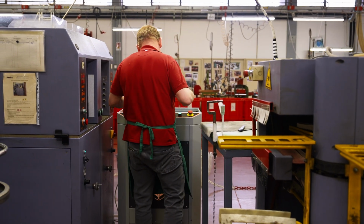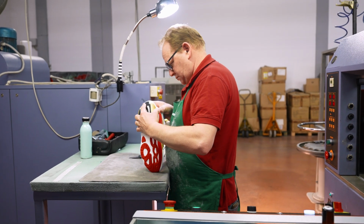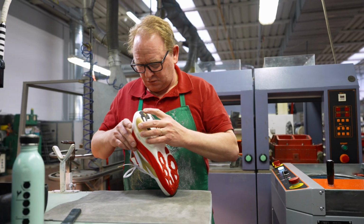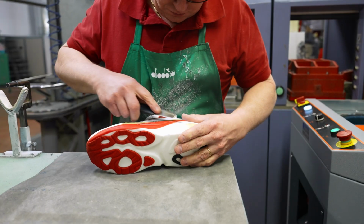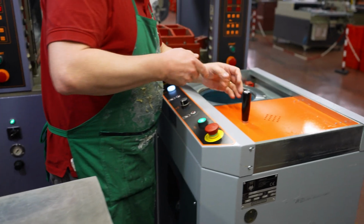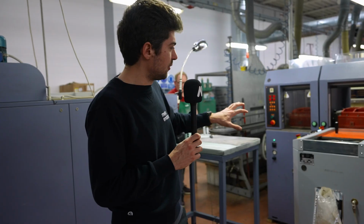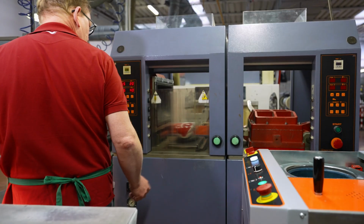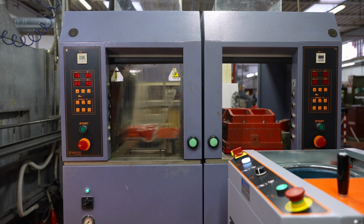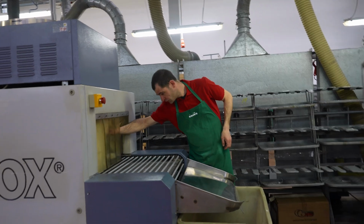Yeah. So, like I said, the glue was being activated in the oven, and now it's being assembled manually here. Literally, the two pieces are being taken together and put, just like you would put your iPhone screen protector on your screen. They need to make sure that it's aligned, that it's looking good, and then they just throw it inside that pressing machine. So it's like a silicone pouch that is being compressed so that the gluing process can be effective. There is first the pouch, so fairly manual step, and then there is actually a press with quite some pressure. I think it's going up to 3 bars, more than in your car tires. And then the shoe is being sent to a freezing machine so that after the glue being activated, it can be frozen so that it's really remaining in place.